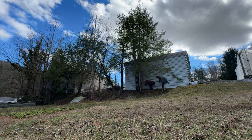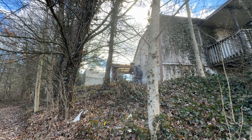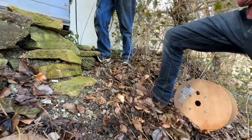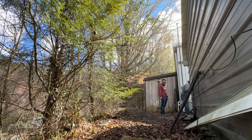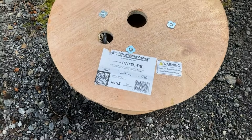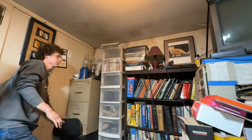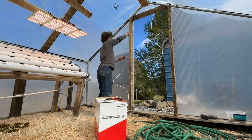The first phase of the process was running the direct burial Cat5e cable from the greenhouse to the shop through the wood line on Jeremiah's property. I then took a small tumble down the hill. We continued running the cable, then chopped the old satellite internet cable and shoved the new cable through the hole. We're using Structured Cable Products Cat5e direct burial cable on a spool for this install — this cable is to be buried and tucked away as much as possible.